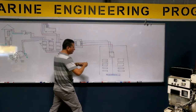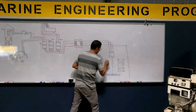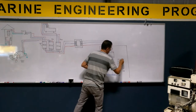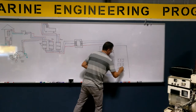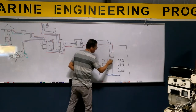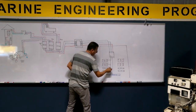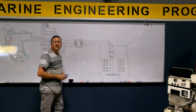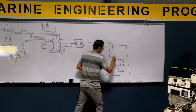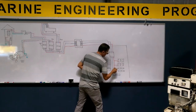Okay, now we are going to do the configuration on the breakers. This is the double breaker, double breaker, single breaker, and single breaker. All right, with hotline number one, the black phase, I am going to feed the first element of the double breaker, and I am going to feed the other single breaker. Everybody follow me? With the red one, I am going to do the same. I am going to feed the second of each breaker and the individual breakers.